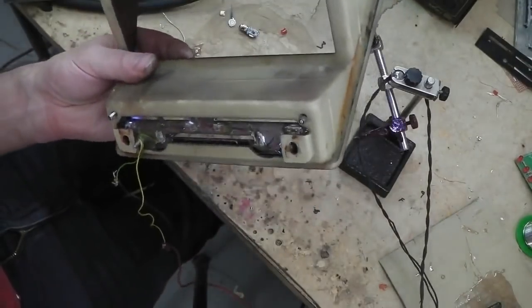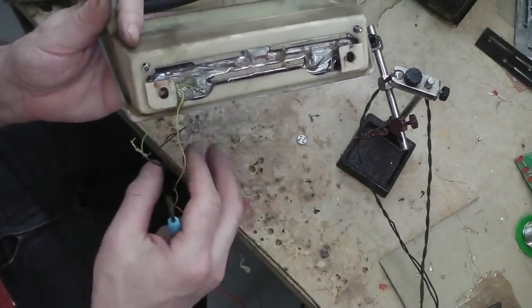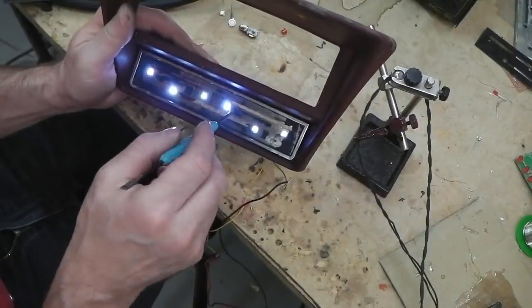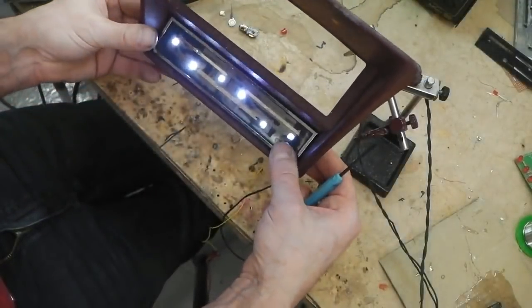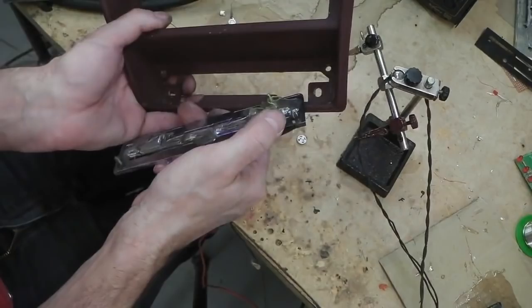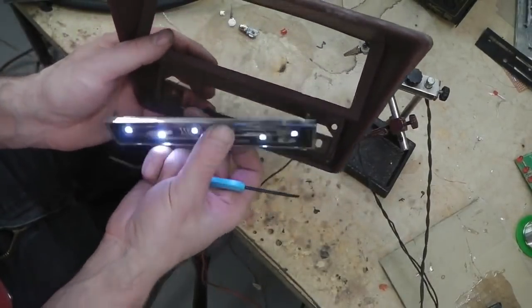As I say, I'm going to leave it on for a few days. It's going to be on a multi-plug here, so when you're in the car, it fits in this way. These on a Cortina, you always pry them out. I just always use a hook to hook these out. They're just pushed in, they don't have any screws. Look, they're just clipped in there, and they just pop into those kind of like retaining studs. So you'd withdraw that and undo the plug, and that's it.